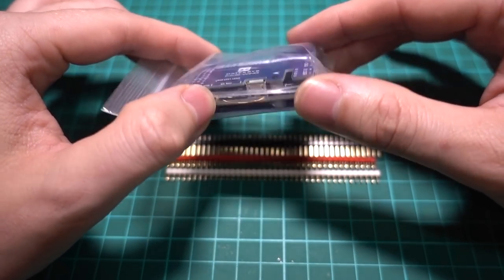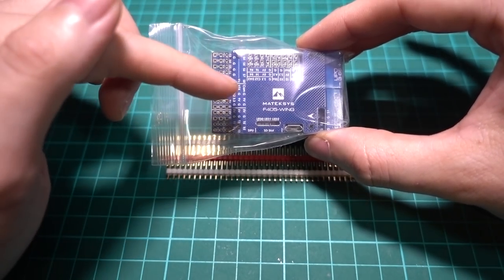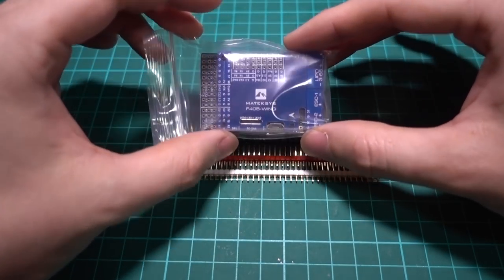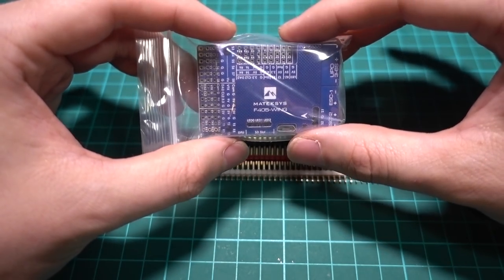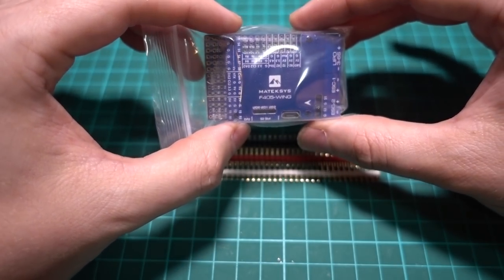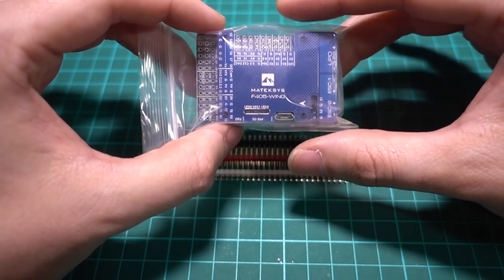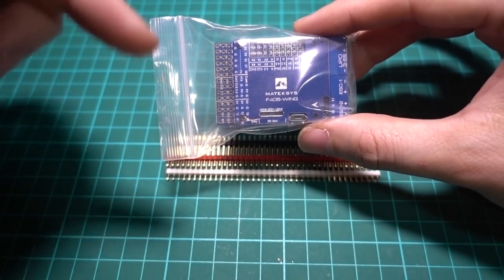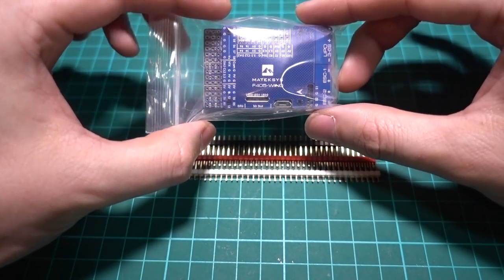Those are the benefits of the flight controller. And of course it can actually power down and power up the DJI Caddx Vista. If you're familiar with quadcopters, the Caddx Vista video transmitter gets hot if it's left running at full power, but here we can disarm it and in doing that process it sets the Caddx Vista to low power.